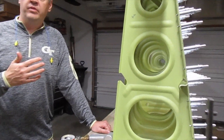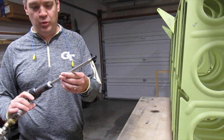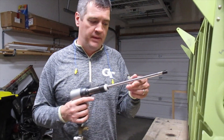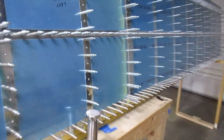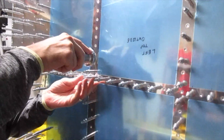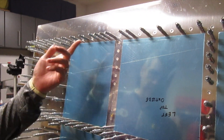Just off of the couple we've done right now, the quality of the rivets are really, really great — they're super flush. But you need some extra special tools to do that. First of all, this is a big, scary 12-inch long back riveting set that I use. With back riveting, you do it from the backside to set the shop head. And then over here on this side of the wing, this is a giant, heavy bucking bar that you hold very, very firm to make sure it doesn't bounce around like a traditional bucking bar, and I set the rivet on the other side.